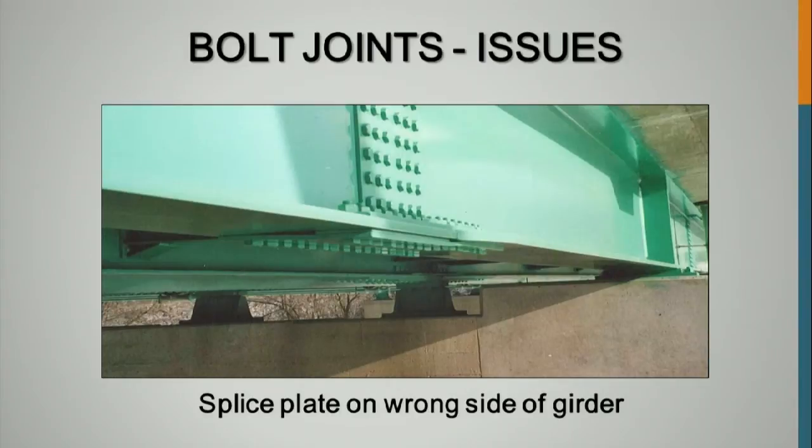And we had a discussion yesterday about this bridge in town with a ramp going off of it, where they got all this nightmare of trying to pull the steel together and put it in place. We had a long discussion yesterday afternoon at the end of the day. They talked about this ramp going off the bridge, and when they tied that steel from the ramp into the rest of the steel, they had trouble getting cross frames in. Then somebody said the pier cap was low on the ramp structure apparently, and that affected how the steel tied in together.